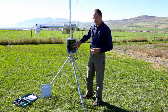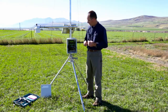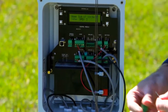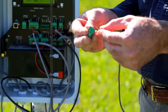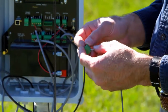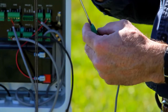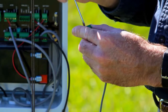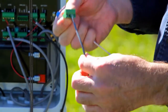We have two leads and two analog ports. The thermistor is installed to one of the two analog ports — in this case, we'll select analog port one. The two leads go into the input and the ground pins, which are the two center positions for the terminal block. This is a pluggable terminal block and uses screw terminals, so it's easy to install and manipulate without having to mess with other wires in the box.